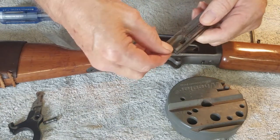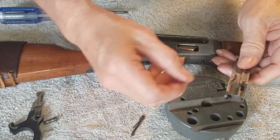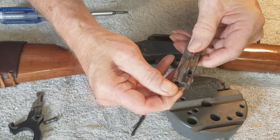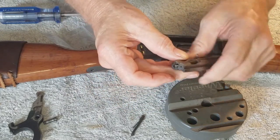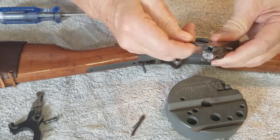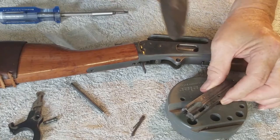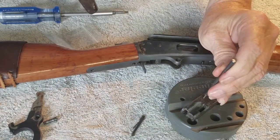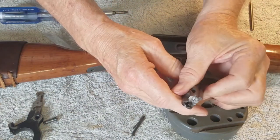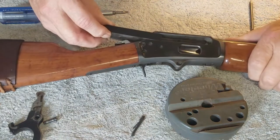Another advantage is it drives the pin just far enough that it stays in. You want to clean this hole out — I've already cleaned it out at an earlier date so I know it's clean. I'm feeling around in there to get it lined up, getting it flush or below. I may have to take it out and polish it, but right now I'm going to put it back in the gun and try it.